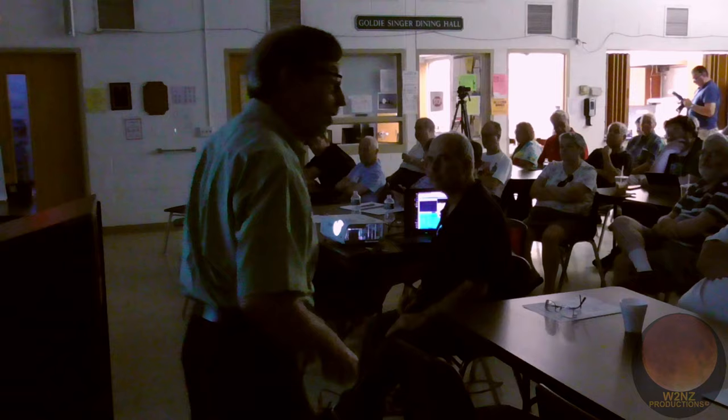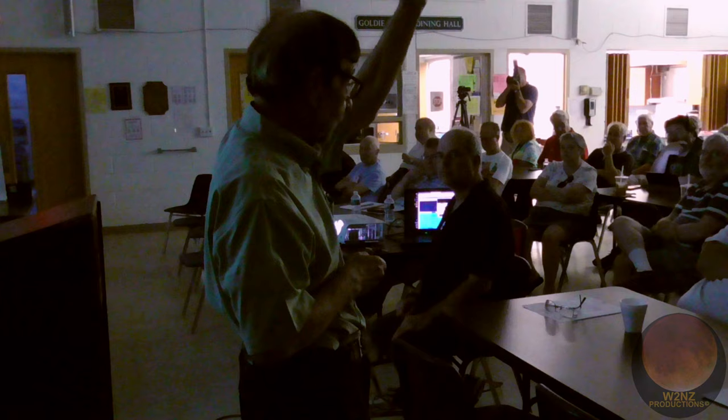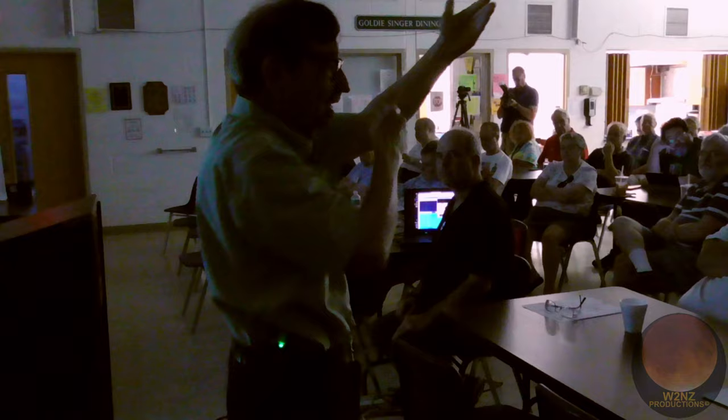So the problem we have with the moon is it's moving relative to the Earth. When the moon rises, it's coming towards you. When the moon gets way overhead, no Doppler shift, because it's standing still relative to you, right? As the moon starts to go this way and set, now the moon's going away, so the frequency goes lower.